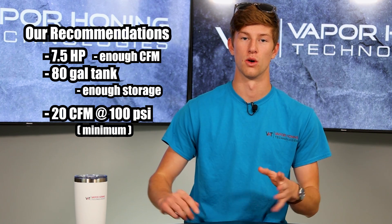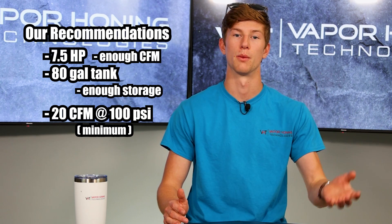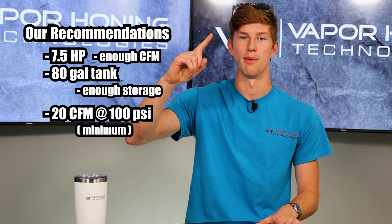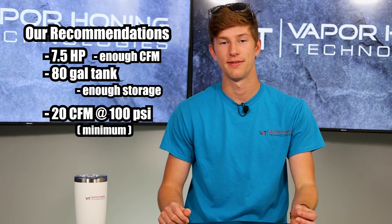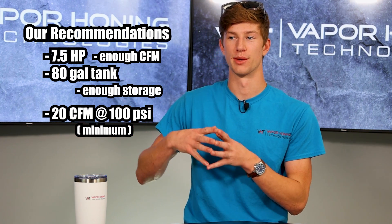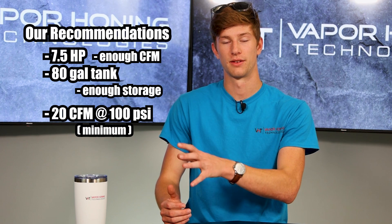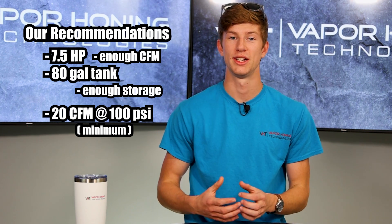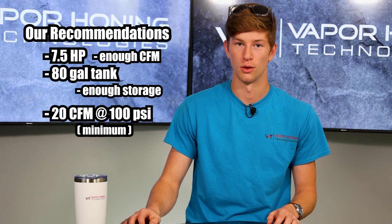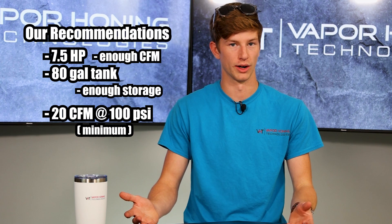For the Weekend Warrior and the 800 FL, you're going to want to have 20 CFM at 100 PSI. Anything less than that and your compressor is not really going to be able to keep up — that's why if you have a smaller compressor, you'll see your pressure gauge actually drop as you're operating the machine. If you have a five horsepower compressor and it's close to that, go ahead and try it. If your compressor is older, sometimes you'll actually lose a bit of CFM. Definitely try your five horsepower first, but if you're buying a new machine and looking to upgrade, most definitely go ahead and get a seven and a half horsepower. With something like the Ingersoll Rand Type 30, the five horsepower is almost as expensive as the seven and a half, so it's really a no-brainer to just upgrade.